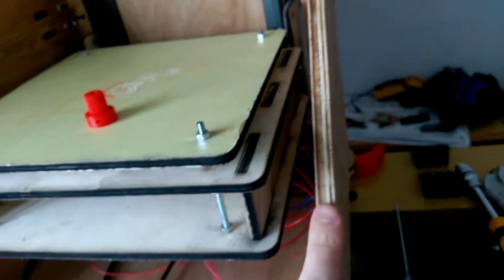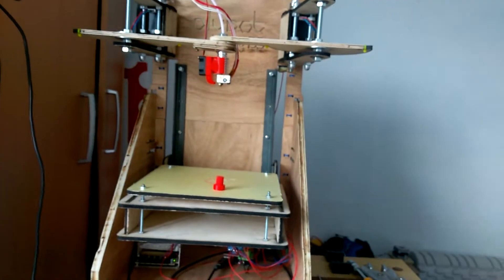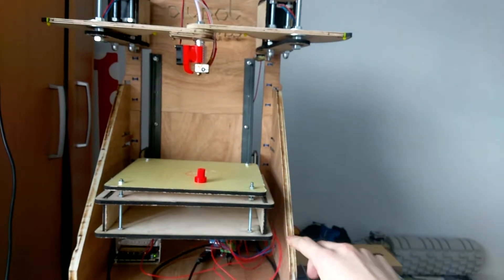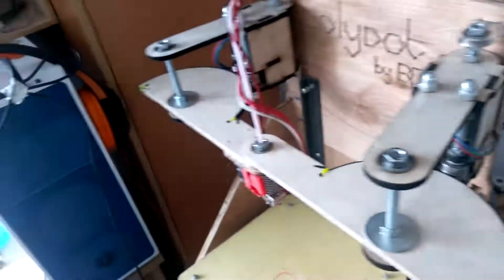I'm also planning on making this frame out of 6mm ply instead of 12mm, to make the whole thing out of 6mm ply. It'll be much easier to manufacture, as this has to be CNC routed and it's pretty difficult to laser cut 12mm. So then if I do that, it'll all be laser cut - this part is laser cut, that's CNC routed, and that's CNC routed.